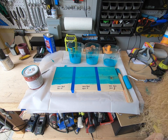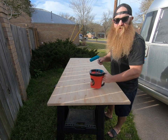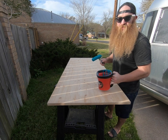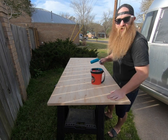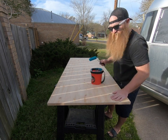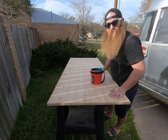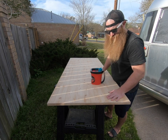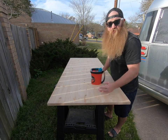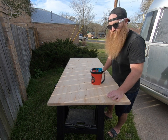So I sent the samples to Britt and the decision came down from the higher-ups, Brittany and Sarah. They went with 75% paint and 25% water — they liked the vibrant look while still seeing a little bit of the natural wood tones coming through. The technique is to apply it pretty liberally to the surface, then before it sets up too much, take a paper towel and go over it. We're going to treat it just like it was a stain — that's how you get the look we're going for. Alright, let's get started.